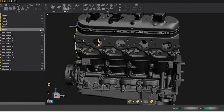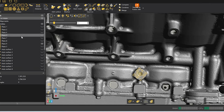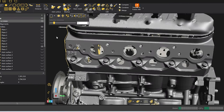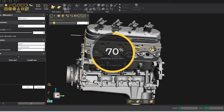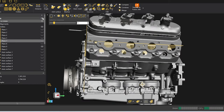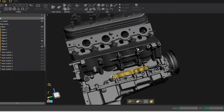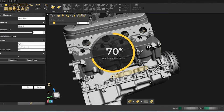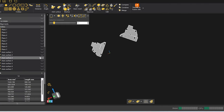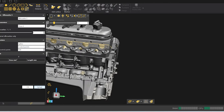So what we're doing here is taking the water pump area and highlighting it, and saying, hey, this surface here, we want that to import into our Fusion 360 program so that we're not working in midair. If you just take this file, it gets imported as a mesh. Basically, it's an incomplete part. It's not a solid, it's basically air, more or less, with some measurements and things like that. But if we take these planes and input them into the software before we go into CAD, it's going to allow us to have something to work with, so we're not just working in space.